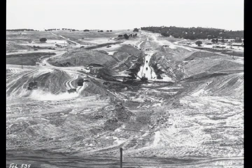Sands and gravels deposited by running water are relatively less dense than soils that develop in place. When exposed to moderate to large earthquakes, these sands and gravels may lose strength because they liquefy. Engineers began to explore and understand this condition in the 1960s, and their initial understanding was supported by the San Fernando earthquake of February 1971.